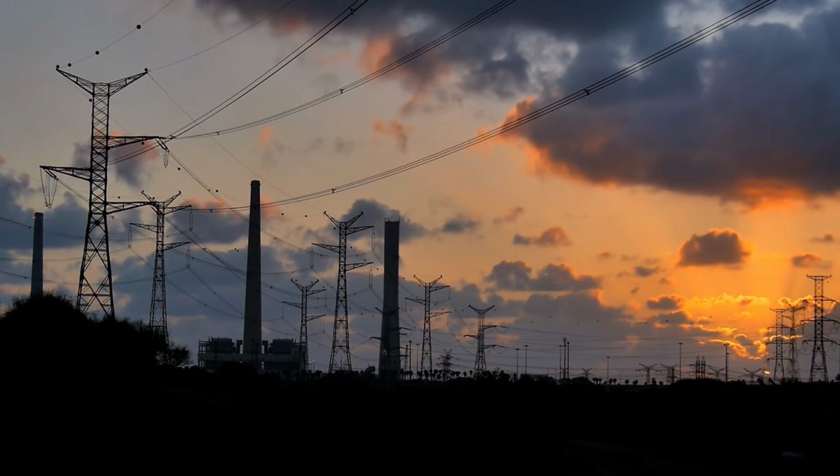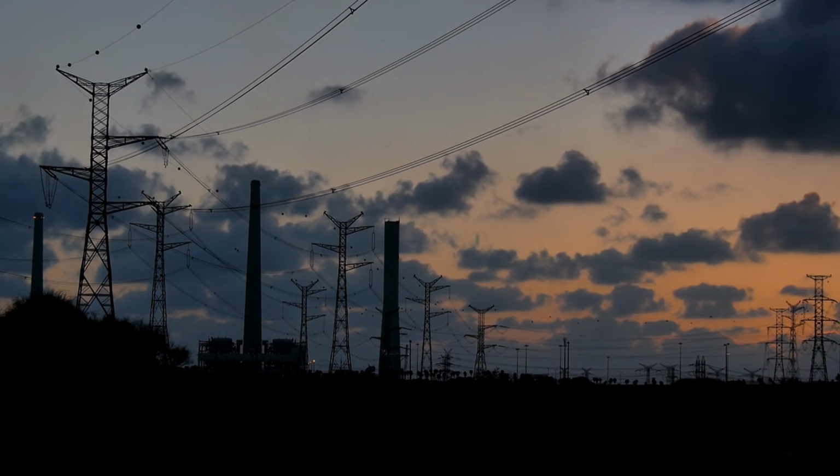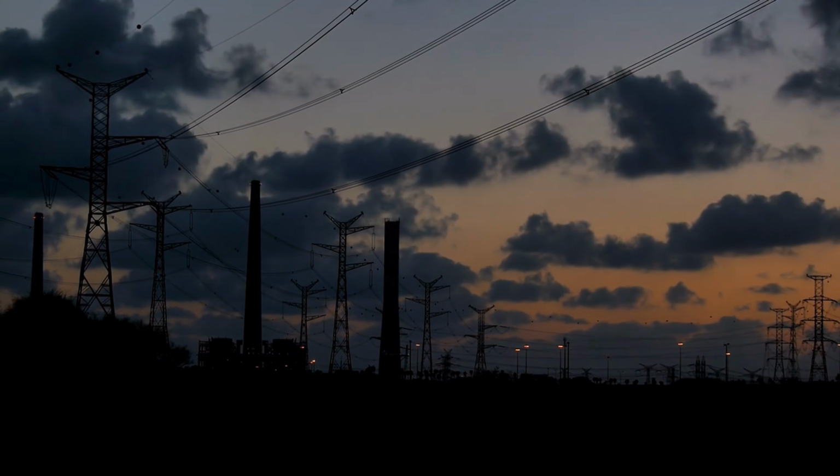So I mentioned secondary basis. Secondary basis means we have to accept interference from other sources as hams, since we are not the primary users of the band. For me, this would be from local utility companies. Meaning I am a secondary user, they would be primary, and around here they appear to be mostly used by smart meters, amongst other smart technologies.